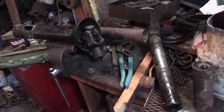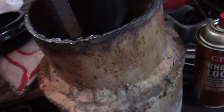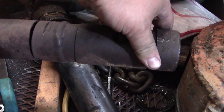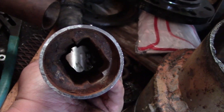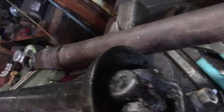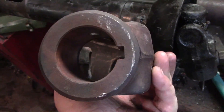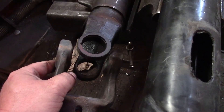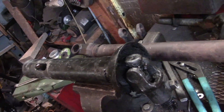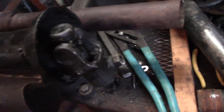Hello YouTube! Today I'm going to be taking all these shafts and convert them into one usable shaft. The reason is this piece originally was on this shaft, so I cut it off. This square is an oddball size — it was 1.19. They do make a square shaft that size, but it's ridiculously expensive. And to buy a total new shaft, this has an oddball size yoke — about 1.5", which isn't odd, just less common. I had to get a new U-joint, so that's why it's parked. Either way, I was going to have to buy a shaft and cobble it together anyway to get the right end, and it was going to be quite expensive, so this is actually going to be cheaper to do.